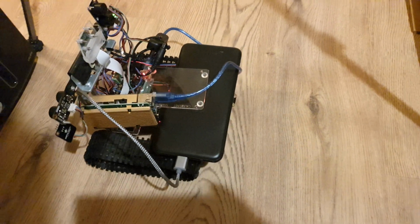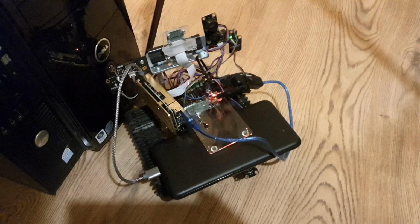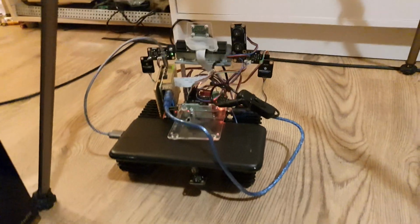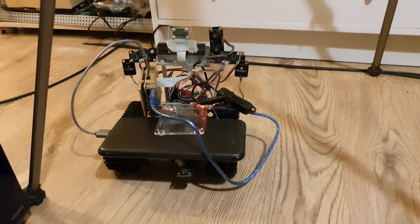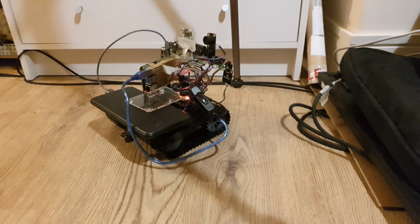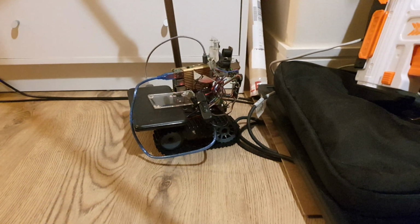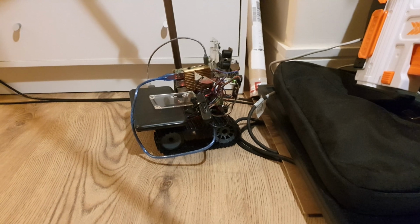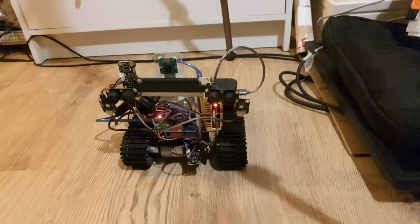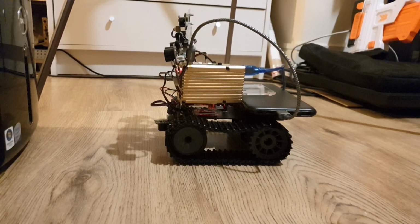So everything we've seen up to this point with the patrolling and moving around wasn't actually patrolling and moving around. It was just a lower level Arduino picking up on the sensors and making the bot move around to try and avoid objects. And now patrol mode should be enabled, which is the current standing order that's been set in the YAML on the Raspberry Pi. So now it should be actively moving around. See, there we go. It's bumped into an object there, but it's managed to avoid it and back away and turn around.